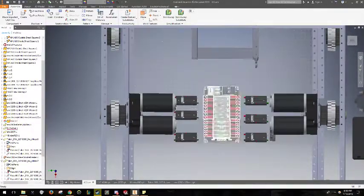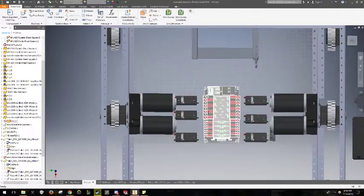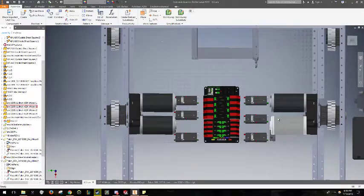So to actually make the decision to change it, I'm going to put the PDP lengthwise along here, since it seems like it fits pretty well. And then I'll be able to have all my motor controllers lined up, and that'll make it easier for the CAN to go across them and easier for the connections to come across.